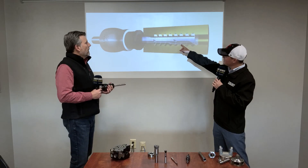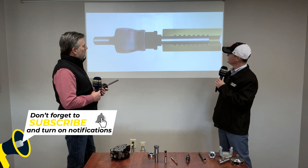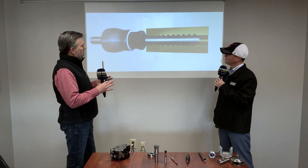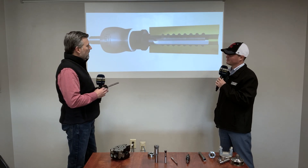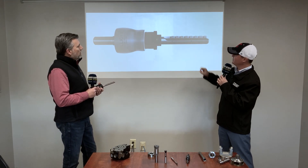As you can see, typically you'd be doing these slots individually with some sort of boring bar and grooving tool on a machining center. These are normally square, cubic blocks of cast iron or ductile iron or similar materials, which really suits a machining center. You'd be looking at doing a circular interpolating milling operation, which is slow.